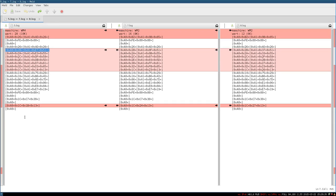The other thing is that we've looked at the read counter. And in the read counter, you see that the first byte is changed when you read it another time. So here we see it's incremented, and here we see it's again incremented. This tells us that it's encoded in little endian, meaning that this first byte is the smaller value and the second byte is the bigger value, which comes in the beginning.